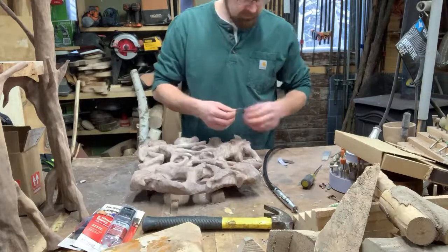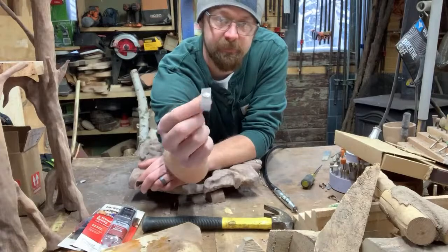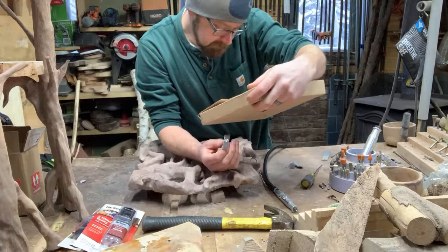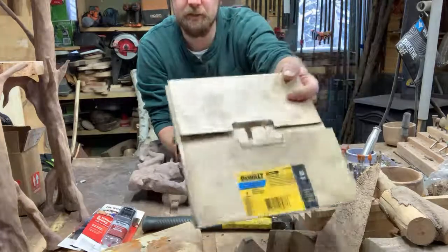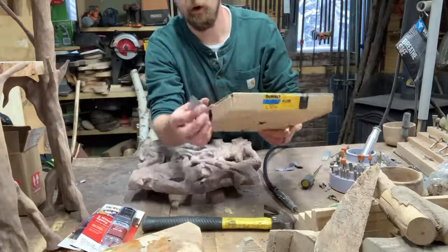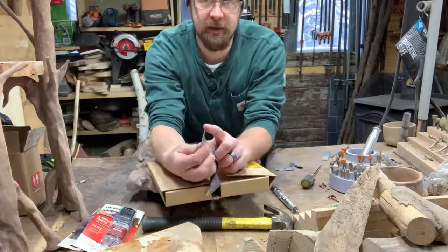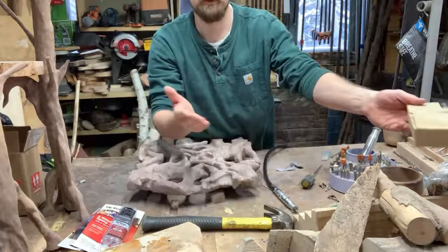So I was just talking about how I make these little sandpaper pieces. What I do is order a whole roll like this of DeWalt, 80 grit aluminum oxide, just a 1 inch shop roll, so it's paper-backed. I was tearing 1.5 inch pieces off like this and using them on the mandrel to sand. But as you're sanding, the edge stays sharp like this. It doesn't really fold over, so getting into those tight spots, it makes its own little scratches, and I don't like it.